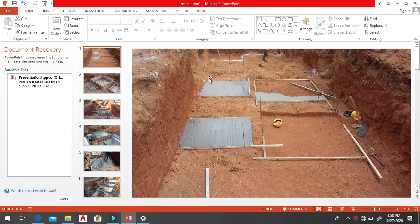You can see that in the edges we have done the excavation, because if we cut from the center it is wasteful — we have to pay more for workforce, excavator charges, diesel, and everything. Therefore when we are in construction and need to do excavation, we have to minimize the excavated soil.